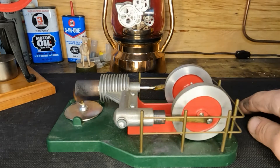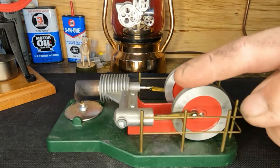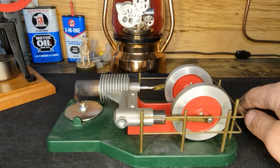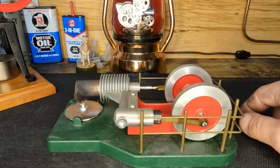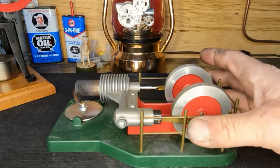See that? Once these pistons get oil on them, that's it. You can get that fire and let it burn as long as you want and that's it, guys. That's about all you'll get out of it. So we need to degrease this one — that's my fault — but you guys got to see why you don't oil your pistons on a hot air engine.